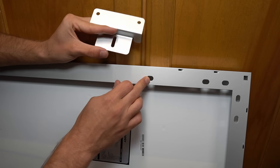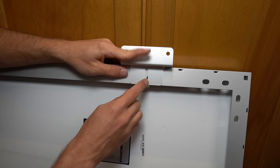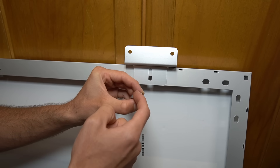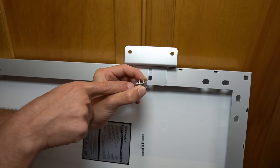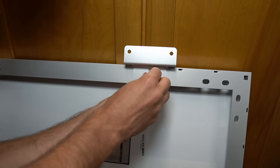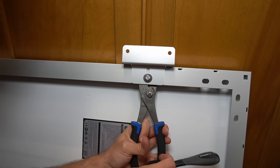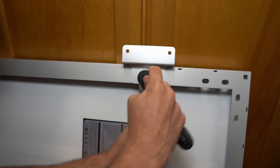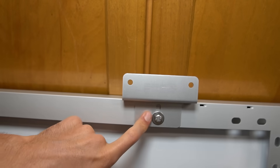The first thing we want to do when mounting the solar panel is add the mounting brackets. You want the configuration to have a bolt, a washer, another washer, a locking nut washer, and then the nut at the end — so the bolt and washer go in front and everything else in the back. You can use pliers or an adjustable wrench on the back and a socket on the front. Wiggle it around to make sure it's solid.